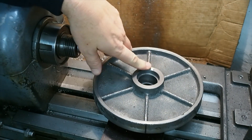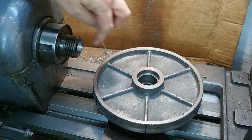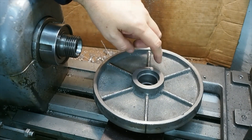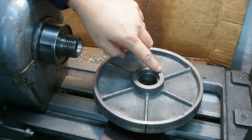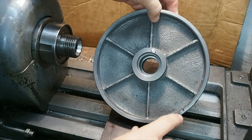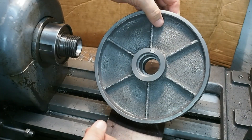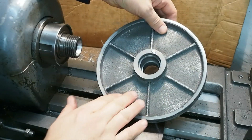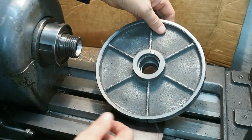As you can see when I started machining the boss for the spindle, I do have an inclusion here, but it still cut quite nicely and I don't think it's going to be a problem. Otherwise there are a few little voids here and there — no great issue. The surface finish is pretty horrible because I didn't put any coal in the facing sand.